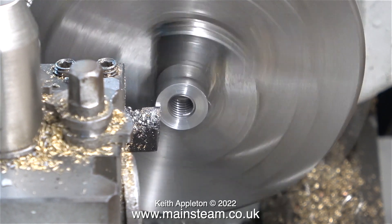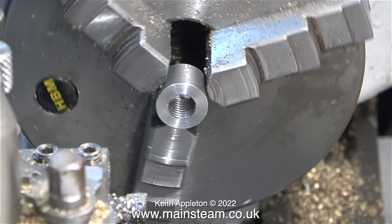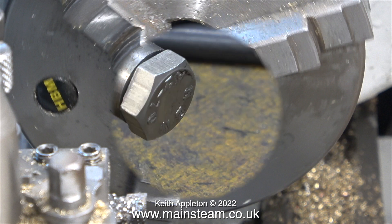After I shorten each of the collars I just touch the edge with the file, because a 90 degree angle — not taking the burrs into consideration — is extremely sharp.